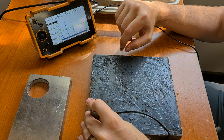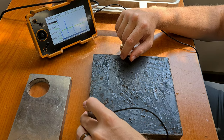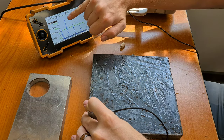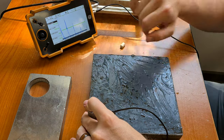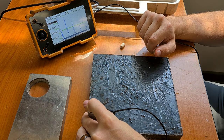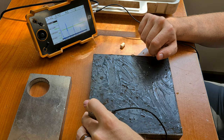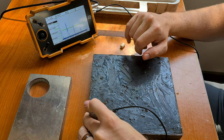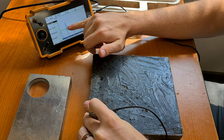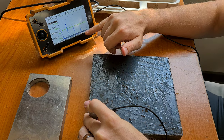Detecting a lamination is fairly simple. We know this plate is about 25mm thick and we can see from our echo here the measurement is 24.8, which means it's about 25 millimeters or one inch thick. We're going to scan and look for defects that pop up between our initial pulse and our first backwall echo. That's basically the area where we are looking.